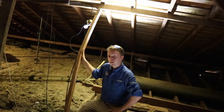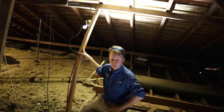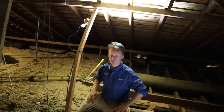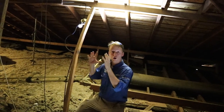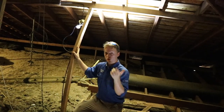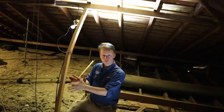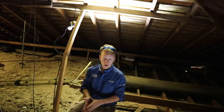One of the next issues found when they installed the roof is actually these bowed and bent purlins in the attic space. Some inspectors automatically think bowed or bent purlins relate to foundation issues, but this actually comes from roofers bringing in 50 to 100 pound bundles and throwing them on the roof, which damages the purlins. Purlins are supposed to be installed at a 45-degree angle or within 90 degrees every four feet, installed onto a load-bearing wall.